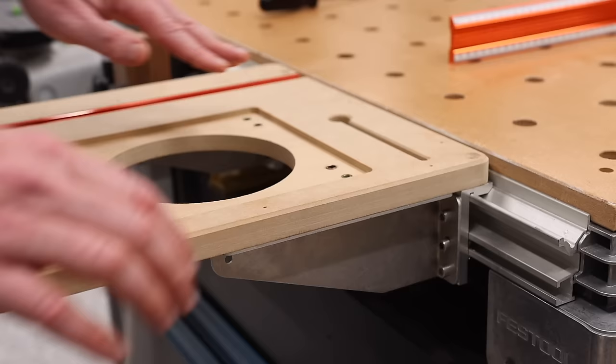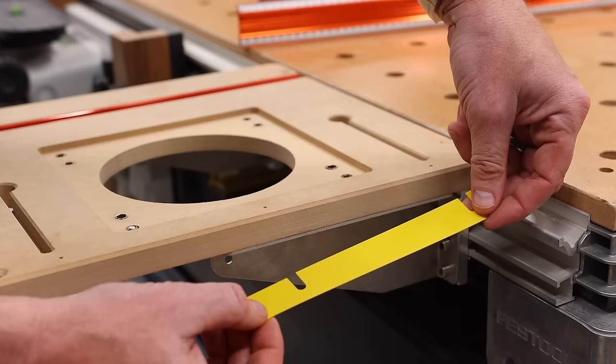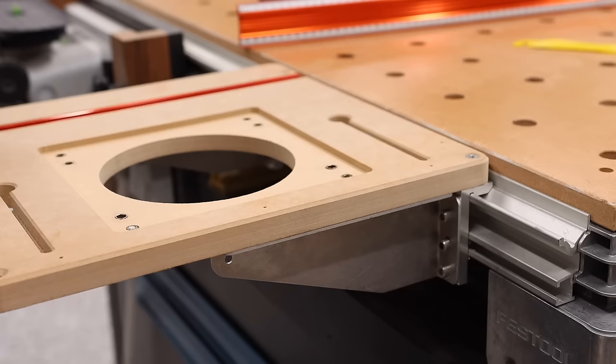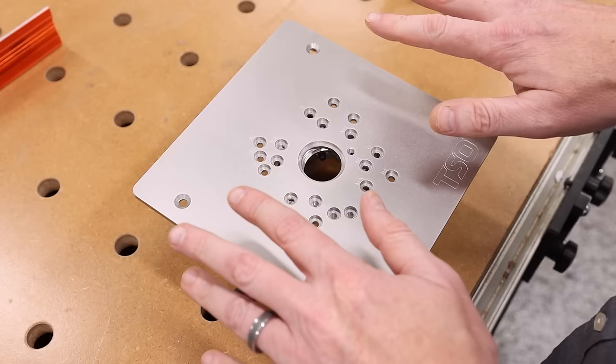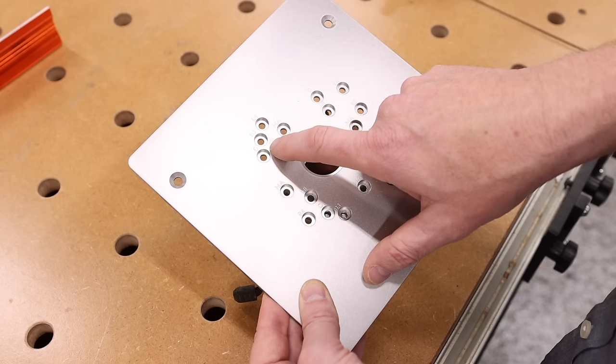From here, I'm going to make sure that I am nice and level across. In the event that you're not, there are shims they provide — you'll see they have three cutouts that go right in line with the bolts used for the bracket. If you needed to raise this up slightly, you would use these shims. It comes with a total of four. Before moving on, I'm placing these final two screws in the top, making sure they are below the surface. Next, I want to cover installing the actual router plate. This plate will work with DeWalt (D), Milwaukee (MI), Makita (MA), and Bosch in either a three-hole or four-hole pattern (B3/B4).